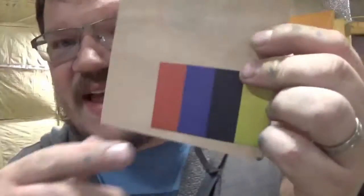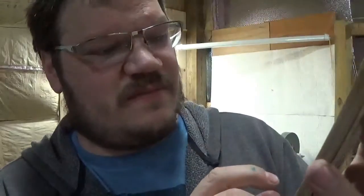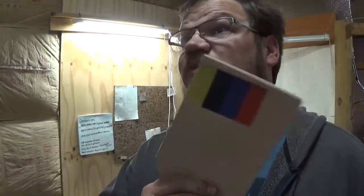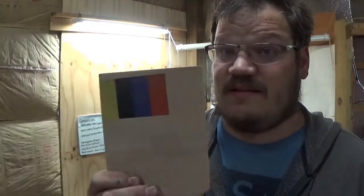After the first inking, this is our first color flag. You see these blacks here and then it goes to good colors — that's looking pretty good. I believe we've got our hard ink in now. You can feel it because the soft ink is a tiny bit sticky; hard ink doesn't feel that way. That's one way you can tell it's in all the way. That's how you change out soft to hard inks. It also works if you're interested in fluorescent inks — we've got some really cool blacks that glow under black light, and you can follow a link to see that.